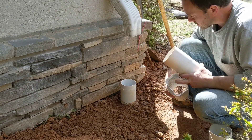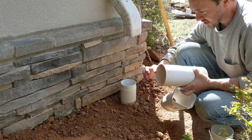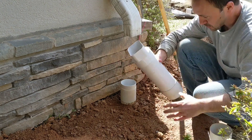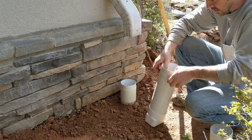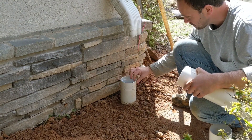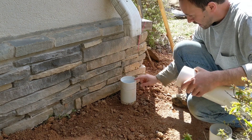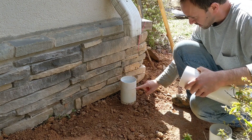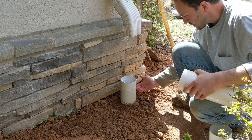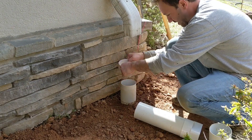This is the main piece of PVC coming up out of the ground. I took another section of bell and just slipped that down around over to act as a stop. That keeps my little lock collar from slipping too far down the pipe. On another gutter I have, that little ring is just sitting on top of the elbow that's coming right out of the ground because it happens to be right there at ground level, so I didn't have to do any additional section to keep it from slipping and sliding.